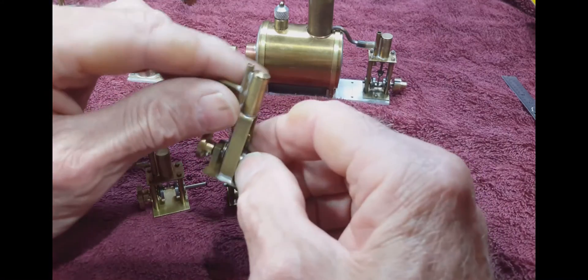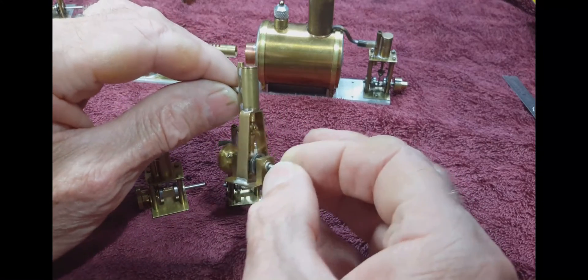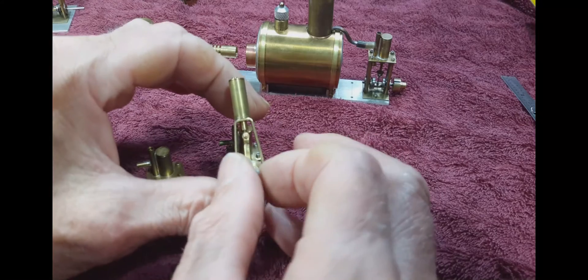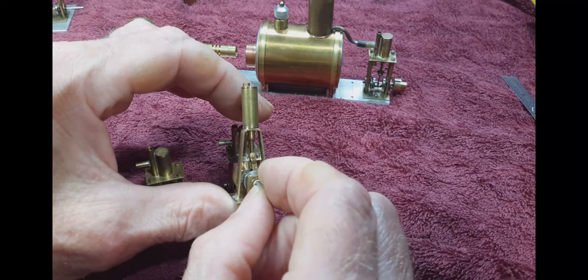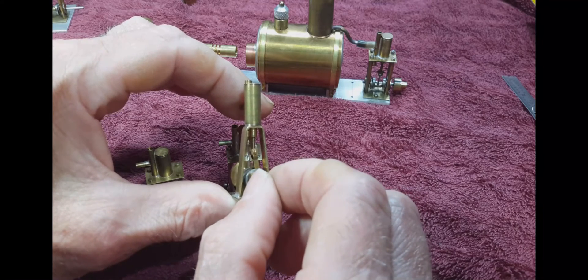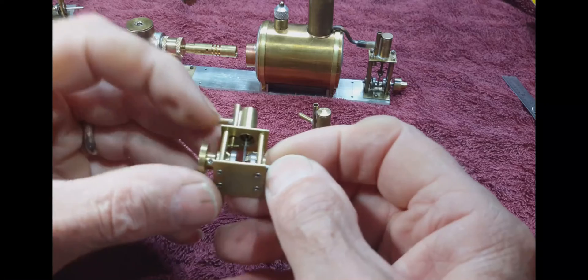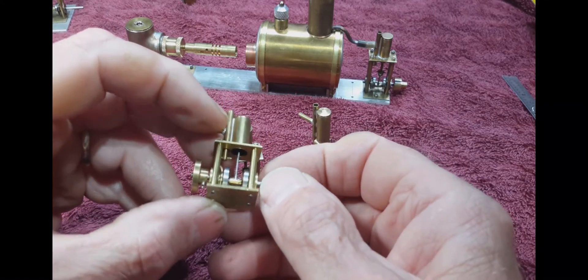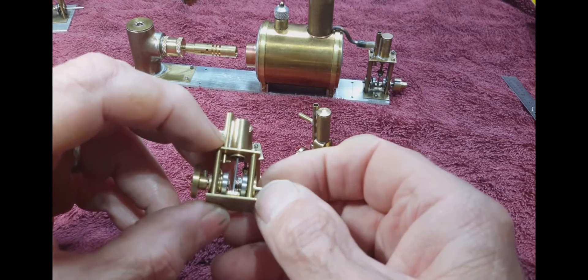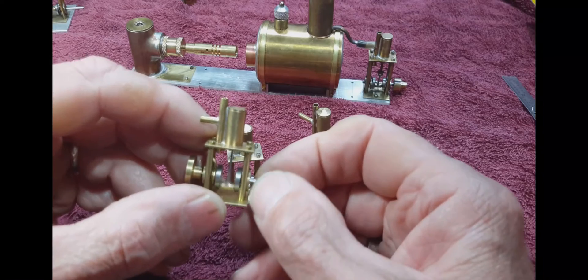and this other little engine, which is a single-cylinder double-acting engine, which has a quarter-inch bore and a quarter-inch stroke, but it's double-acting so it uses twice as much steam per revolution. It has a power stroke on the down and a power stroke on the upward movement of the piston, where this little engine right here, single-acting, it has a connecting rod and piston like a typical internal combustion engine with a wrist pin and a connecting rod in the piston, open on the bottom side of the cylinder so it only has a power stroke on the downward movement of the piston.